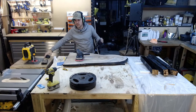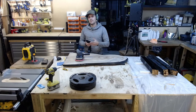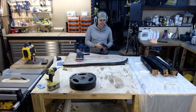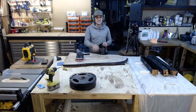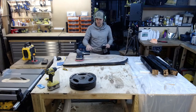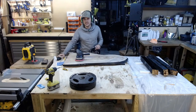Oh, we didn't record this session. We start recording, guys. So now I have to run another intro. Sorry, guys. Again, today we're going to continue with our live edge coffee table. We're sanding the top, because we finished the bottom already, to about 320 grit. And then we'll see how much we still need to sand the epoxy here. And we're going to jump right into it.